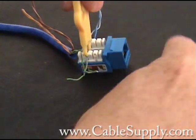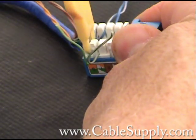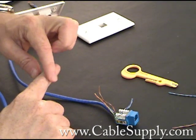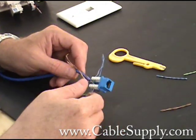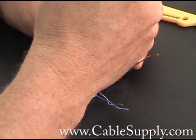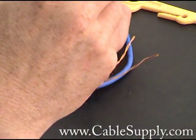I'm just going to push it down. You're not going to hear any noises or anything — it's just pushing it in. What it is, is two pieces of metal that are together, and when the cable goes in, the insulation gets stripped and it gets held there. But notice these aren't cut. Now I'm going to use the professional punch-down tool. The cable is cut at the same time it's punched down.